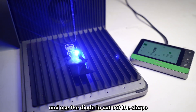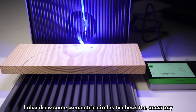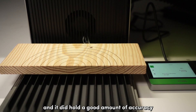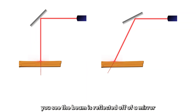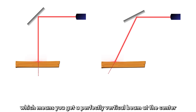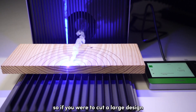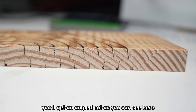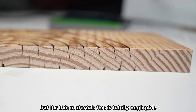I drew some concentric circles to check the accuracy. Each circle is 20mm larger and it held a good amount of accuracy after proper calibration. However, there is one little problem when it comes to cutting — the beam is reflected off a mirror placed inside the head, which means you get a perfectly vertical beam at the center but near the edges the beam has a certain angle with the work surface. So if you cut a large design along the edges of the work area, you'll get an angled cut. This is the case with all Galvo-based setups, but for thin materials it is totally negligible.